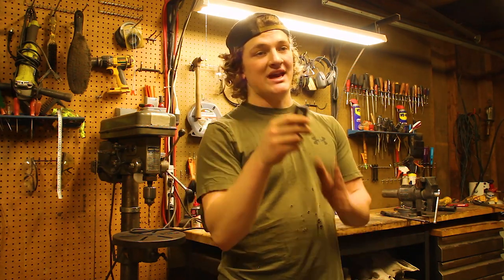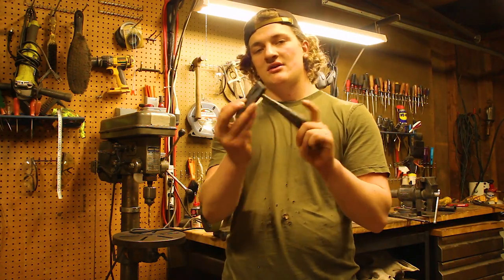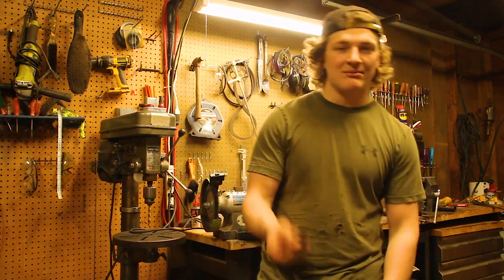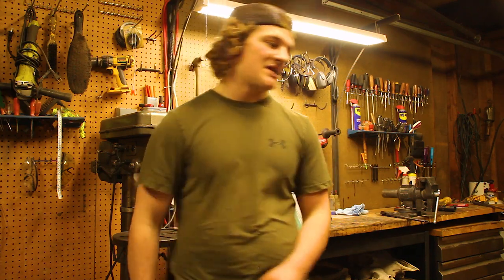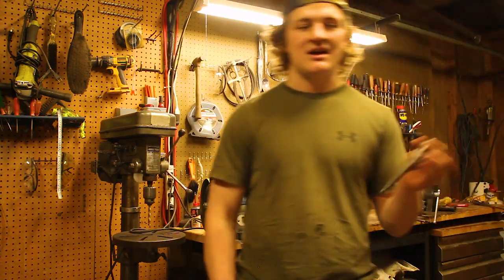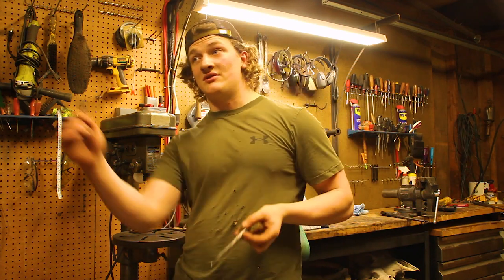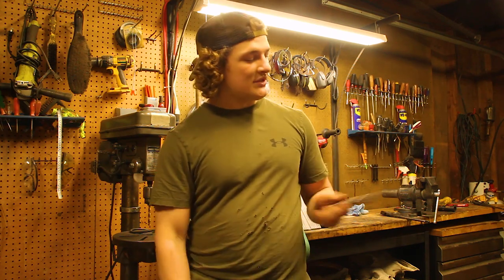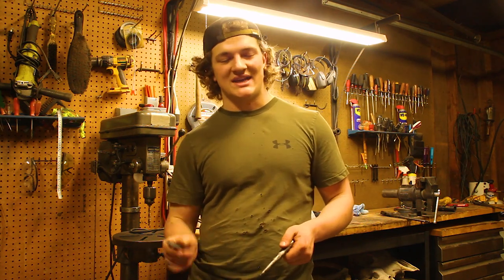Punched out. That is where I'm going to draw the handle out. Spent a ton of time forging this guy out today so that we could grip that punched slot out and make it big enough to fit around the horn of the anvil. Well, that was a huge waste of time because while I was just forging away, I saw this tucked in a little corner. This is the one I used before to do those other blacksmith style knives. I think I'm still going to use the one I worked on today, just because it's a little bigger, and it'll save me a little time.